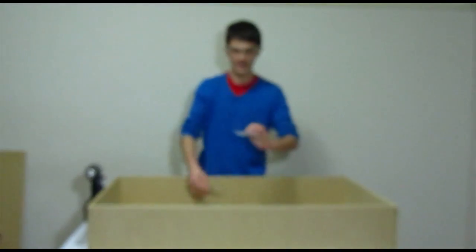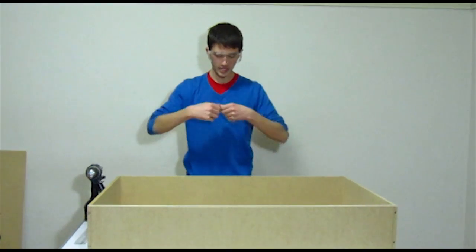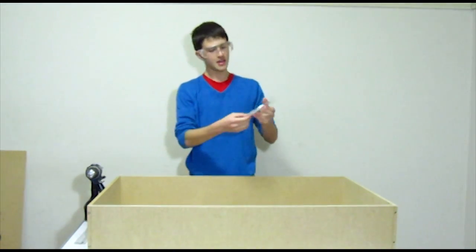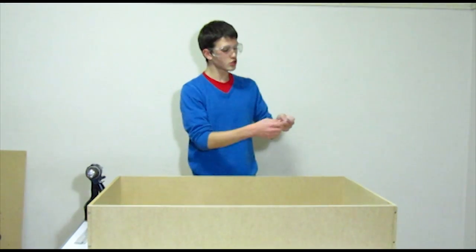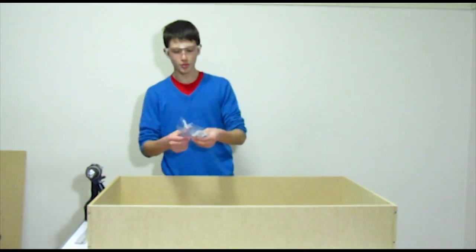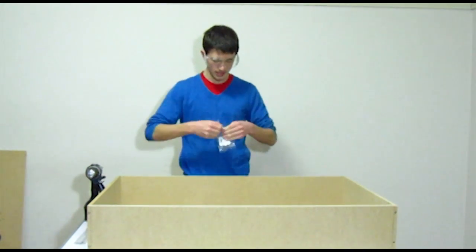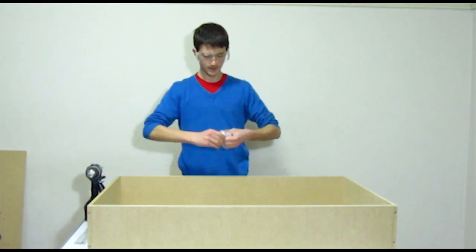So this is actually very simple. All we want to do, because these screws are actually different in size, and because they go in from one end, they come in from the inside and they screw into the outside. We won't be actually needing a countersunk bit or even the 2.5. Because these pieces are actually 4 millimeters in thickness, we'll be needing a 4 millimeter thickness drill bit.